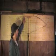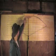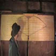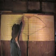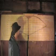So for what I want to see in this bow, I want to see it bending a little less in here. In the beginning of the draw, it begins to bend here, whereas this one is bending more evenly throughout the limb. So with this bow, I would be taking probably a little bit off the entire limb here to even out the bend that is happening with this limb, and then working on the end over here.